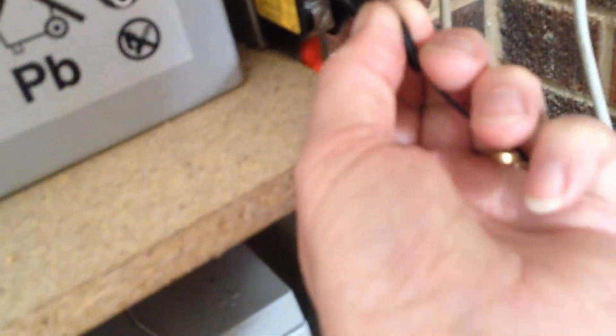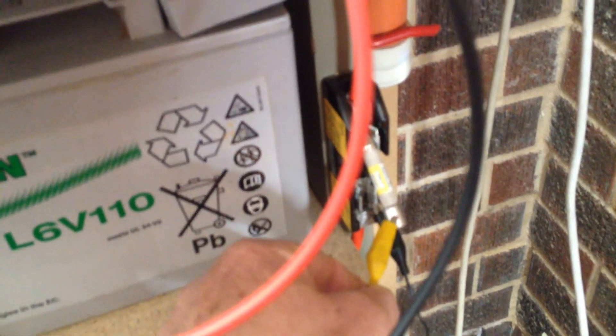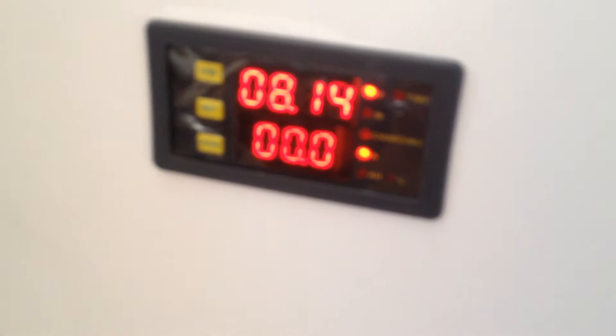What we simply do is connect one end to our 50 volts — I'm trying to do this left-handed — there we go, so that's connected there. The other end is connected via this, and when I pop this on here I'll probably blow the light, I don't know. But there we go — you can see that because of the resistance of the globe, it's not actually lighting it... oh, it is a little bit. There it is, and I'm bringing the voltage of the capacitors up slowly.